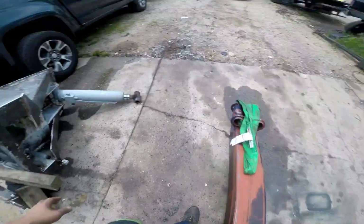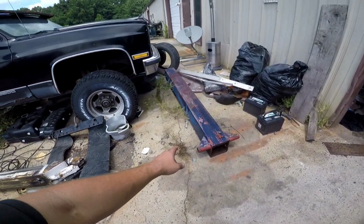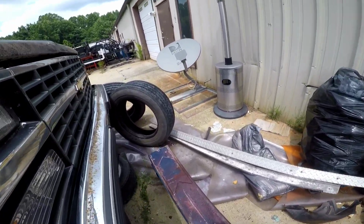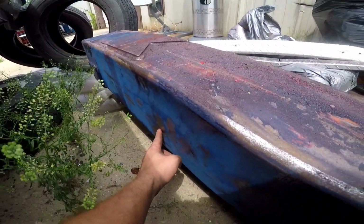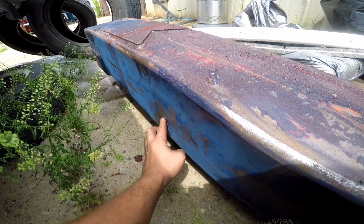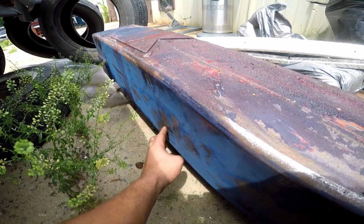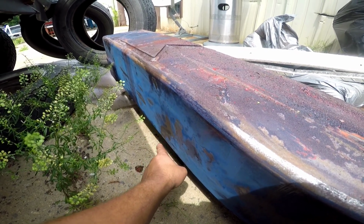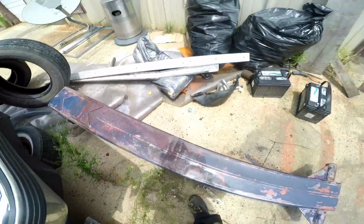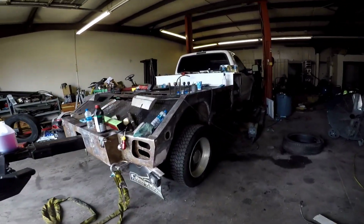As you can see, that's the old mast, that's the inner boom, and that's our outer boom. I couldn't use the outer boom because some knucklehead at one point hit it here, so the inner boom was rubbing the entire time on the inside. Usually when you take the pads and the set screws out of these, booms slide out by hand. You can pull them out really easy. This wasn't the case, and I was wondering why it was bound up. And then when I started knocking the paint down, we found that somebody tried to hide that there. So this is trash. So we're reusing the old outer boom, which I got over here.